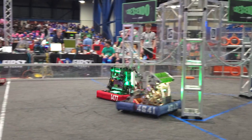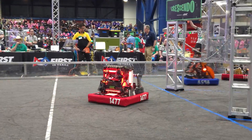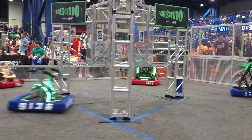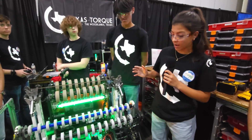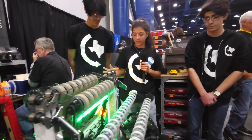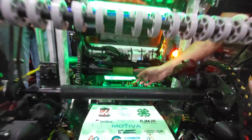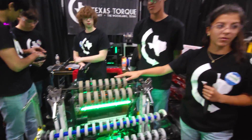Perfect transition into the shooter. Sophia, talk to me about your shooter mechanism. It seems like it just goes straight into your shooter and then shoots. So this season we decided to go with a pivoting shooter because we knew that we were going to want to shoot from both sides of our robot in order to make our autonomous a lot easier. We have a shooter on a chain pivot, which is powered by a Max Planetary. We feed from the front, which is different than most other teams. We found that if we have gatewheels at the back of our shooter, we're able to hold the note inside of our system until we're ready to shoot and our flywheels can rev up independently.